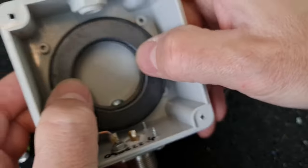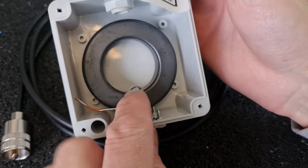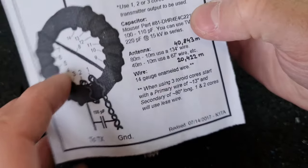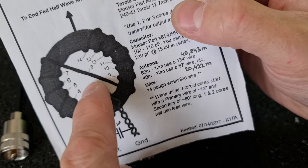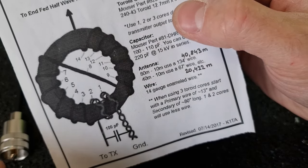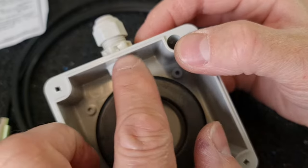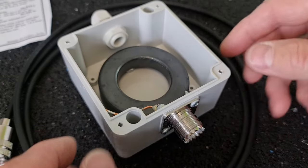And I will make maybe 7 windings of coaxial cable. And as is shown on this picture, I will align this coaxial, turn to the opposite side of the toroid, and then I will wind this toroid for another maybe 7 turns up, and then through the hole of this transition up to the antenna.